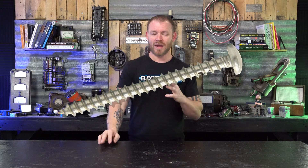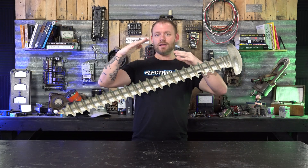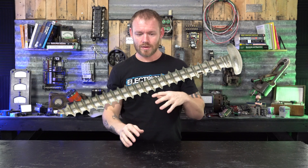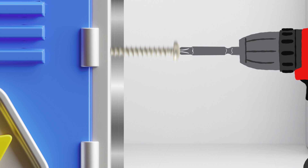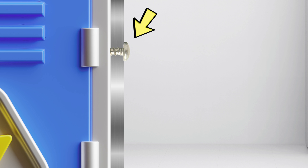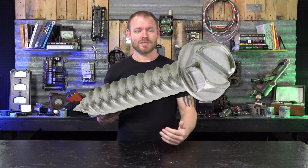There are also screw types defined by the design of the head rather than the drive slot. Pan head screws allow a smooth finish on top — in commercial work I'll use pan heads to mount boxes because it's a smoother surface compared to a hex head sticking out. However, pan heads usually come with a Phillips tip, so you're still at risk of stripping. A lot of people prefer hex heads because you're not going to strip those out.